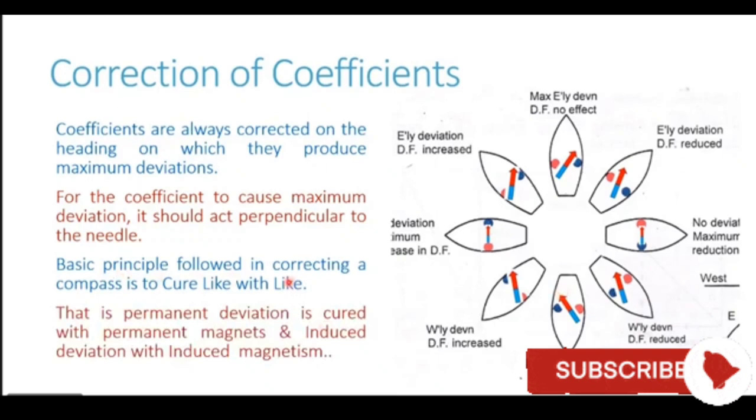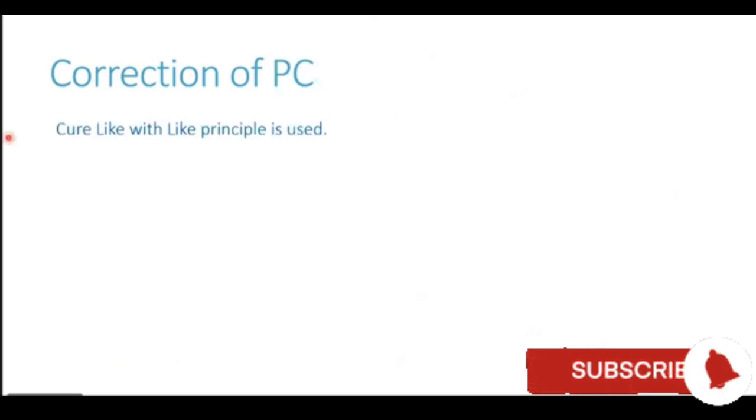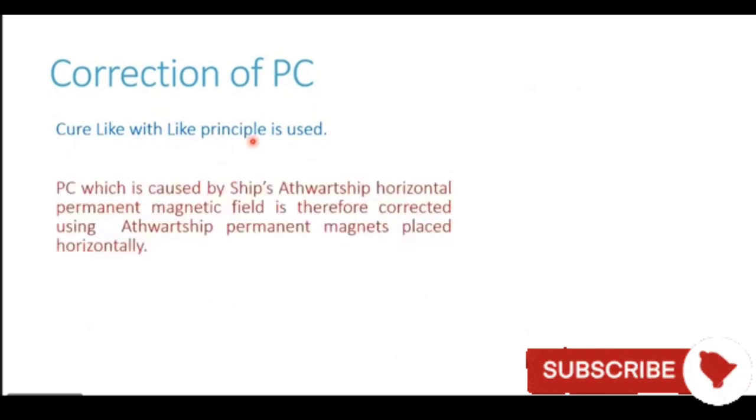Basic principle which is followed in correcting a compass is to cure like with like. That is, a permanent deviation is cured with permanent magnetism and induced deviation is cured with induced magnets. So in our case, this is being generated because of permanent magnetism of the ship. So we will be using a permanent magnet to correct coefficient permanent C or PC. So as we just now saw, the cure like with like principle is used in the correction.